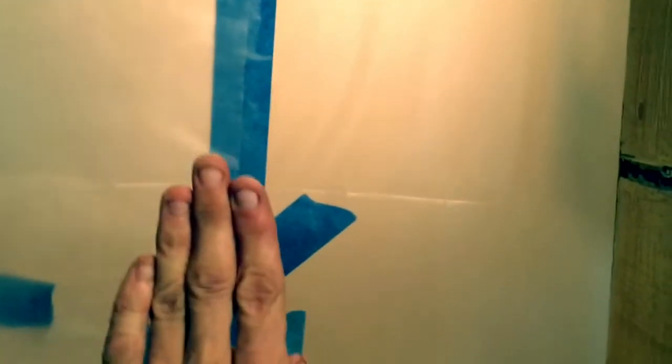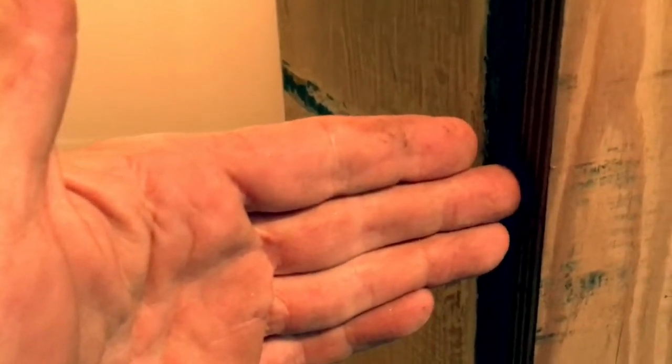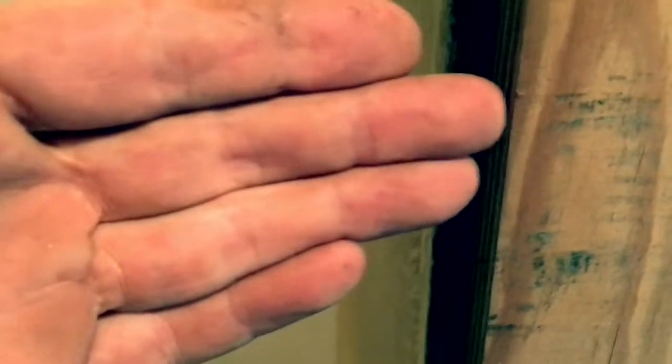Apply your door and your hinges, line them up neatly with just ever so little gap, and use it. If it's catching when you shut it, you'll want to taper the door a little bit, much like a regular door is, to where the inside piece is not square with the outside piece. It's actually at an angle away from the frame, going close, so that when it swings, it doesn't catch.